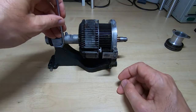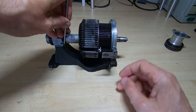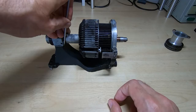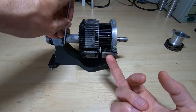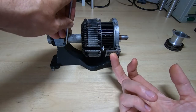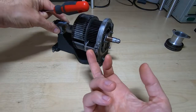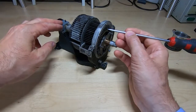I need to use a screwdriver because it is quite a lot of force that's required to make this work. So this is pushed across by the control mechanism, which we'll look at in a future video. We can then set these pins depending on the code that we want to set. So I'll set the first two up. The pin hasn't dropped down yet, but when I release the bearing on the left, the required lever falls down into the space, and in this case it's this one.